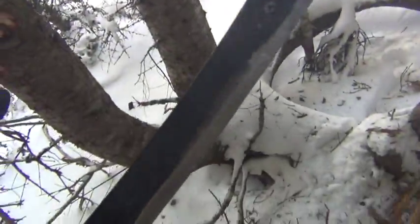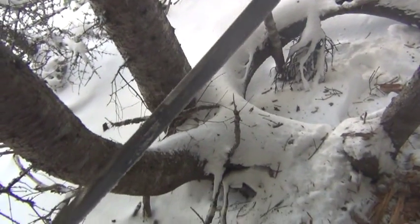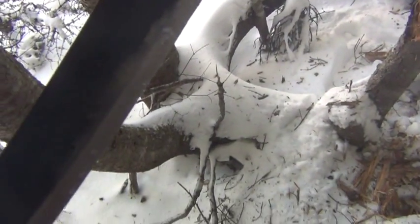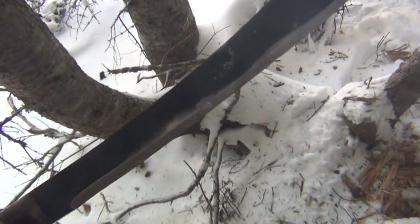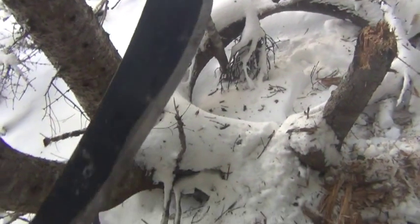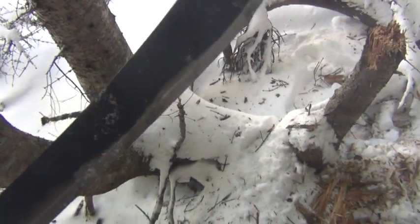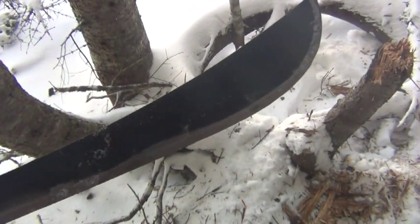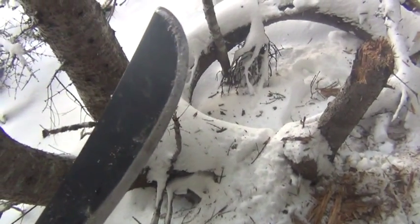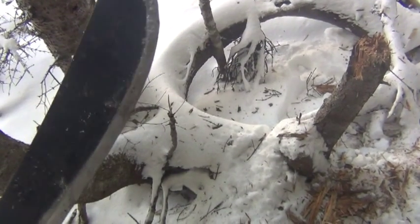The problem some people are having is that Condor puts the same width of edge along the blade, but with varying edge thickness — because the edge is essentially the same thickness as the spine with no primary grind. So you end up down at the base of the blade with an angle around 20 degrees, and as you sweep up through, you get an angle of around 10 degrees up around the tip. That's perfect — it gives a very versatile blade. You do very heavy cutting down at the base for coconuts or hard material, around 12–14 degrees in the middle sweet spot for wood cutting, and around 10 degrees near the tip for cutting light vegetation. But they were getting negative feedback because people were using that tip area for very heavy cutting, and with the edge really low at around 10 degrees, it was starting to ripple, dent, and turn.